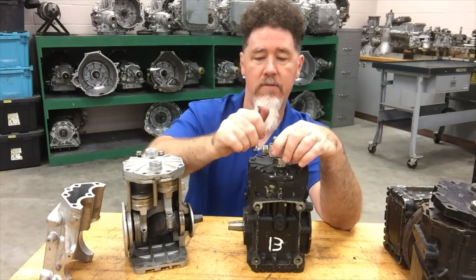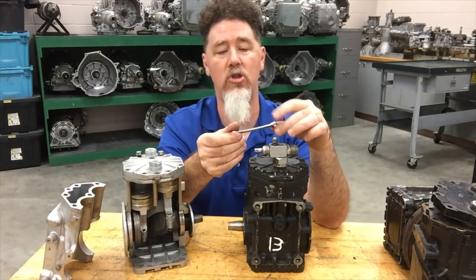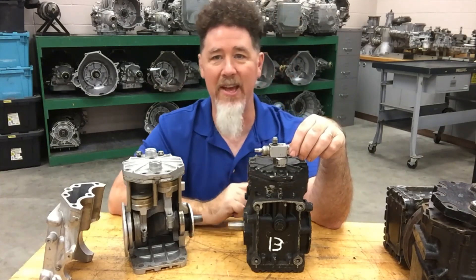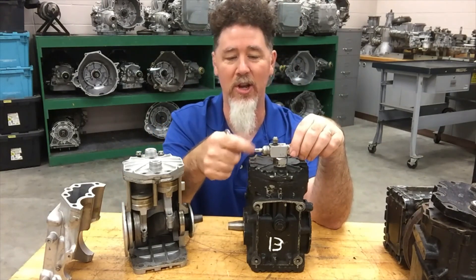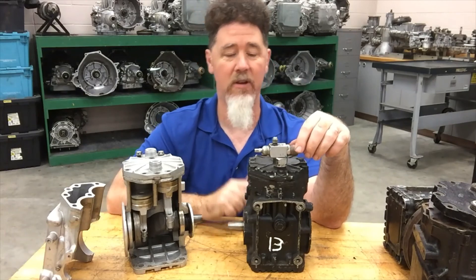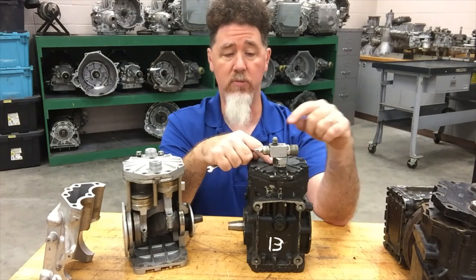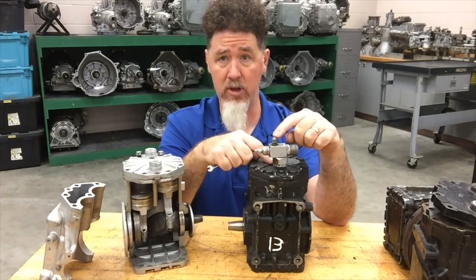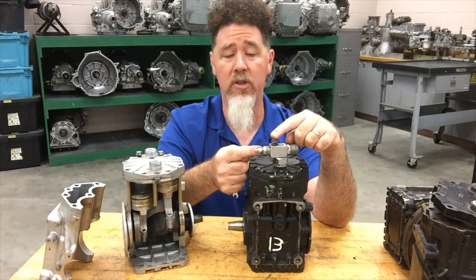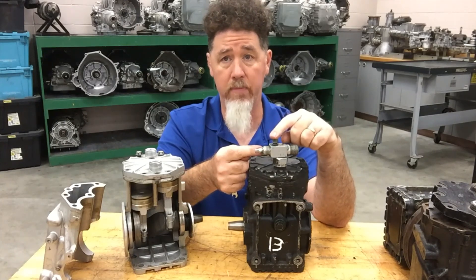If I put this valve to the mid seat position — turn it a couple of times, and I like to use a quarter-inch wrench versus a pair of pliers, because if you use pliers you're going to round off that square drive and then you're going to have to use the pliers forever. Now, not only is the unit and the outlet of this service valve operational, but now you have refrigerant coming out of this port right here, which is where you would physically hook up your gauge. So the only time you move it to the mid seat position is if you want to hook up your gauges.